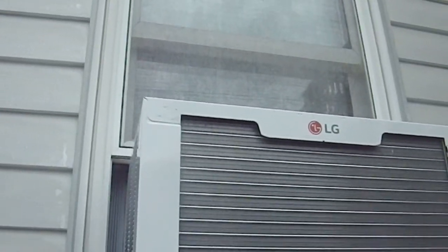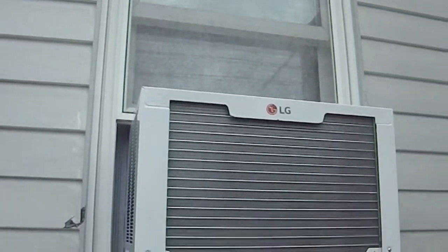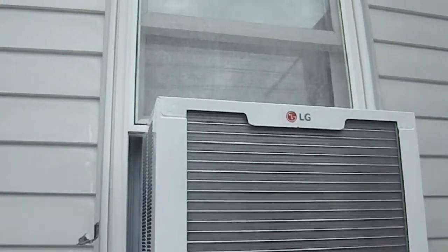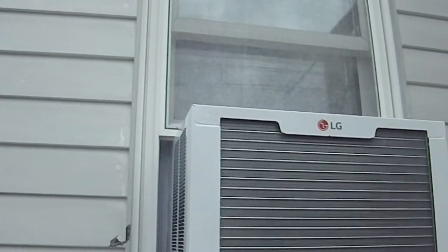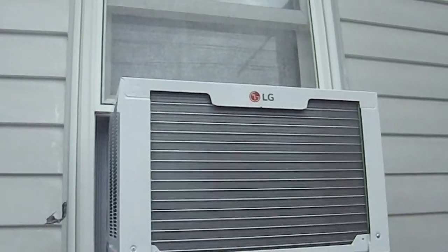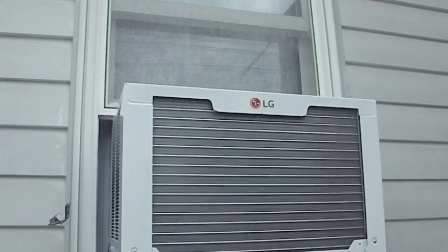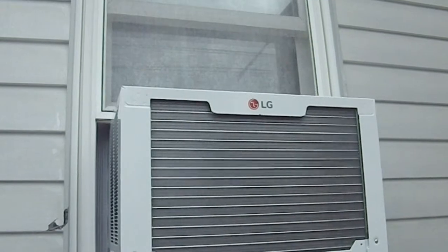The reason I'm doing that is this is the south-facing side of my building — it gets direct sun all day long, all year long. There's some shade from the bump-out, but for the bulk of the day it gets a lot of direct sunlight. That's not good for an AC unit trying to do its job. By giving it some shade, that will help the unit perform better and put less wear and tear on the motor.